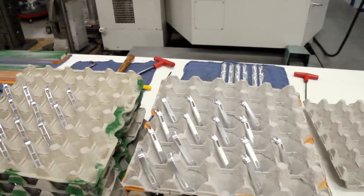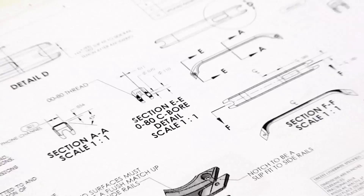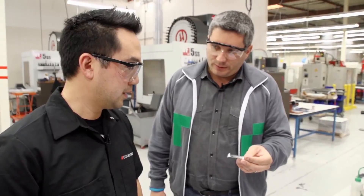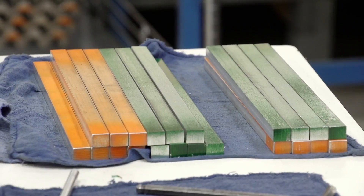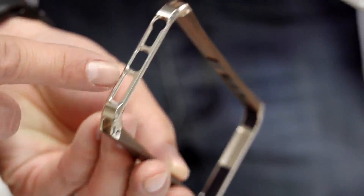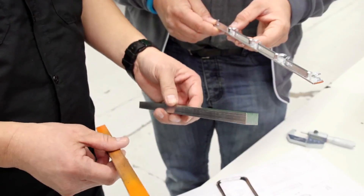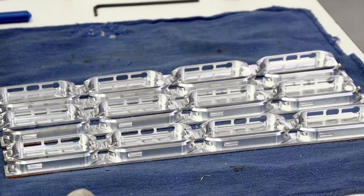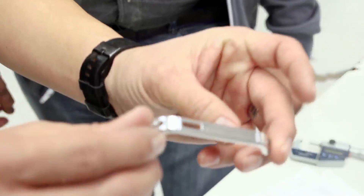Let's look at the top and bottom, which are these nickel-plated aluminum pieces. These are the plans for making them, and they're machined the same way as the power buttons — starting off with bar stock aluminum. We have a top and a right side of the case: that's the top side, and that's the bottom side where the connector ports go. Here at K-Fab we make sure all the parts are color coded so we know exactly which fixtures they go into. The part goes back into the fixture and then the back sides get machined off and finished for the final operation.